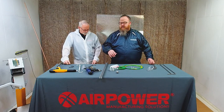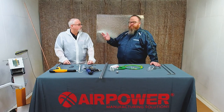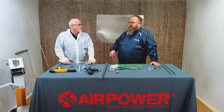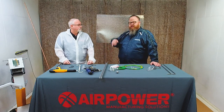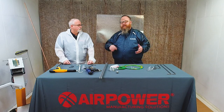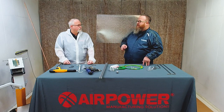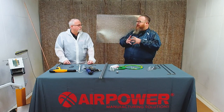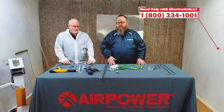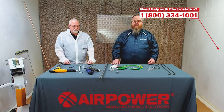I've also heard some of the old timers talk about a trick that they would use. They would build the booth in the shop. They would drill their hole through the concrete and get down to dirt, and they would bore out a good starting hole for about a foot or so, and they would take rock salt like you used to in an ice cream maker. And they would pour rock salt down in that hole before they drove the copper rod in, because it would help to break up that copper and get more branches of it to try to get a stronger ground. Just for the sake of getting a better ground, because it's that important.